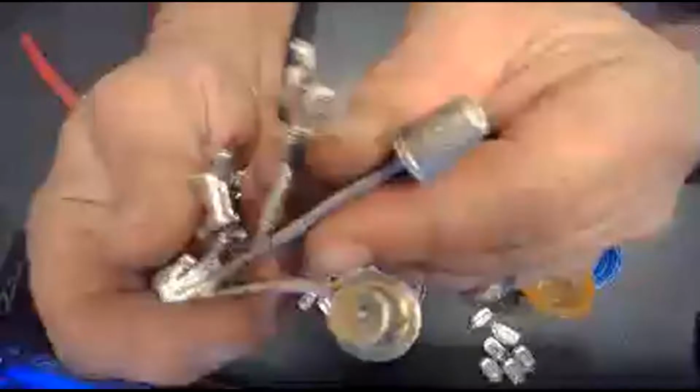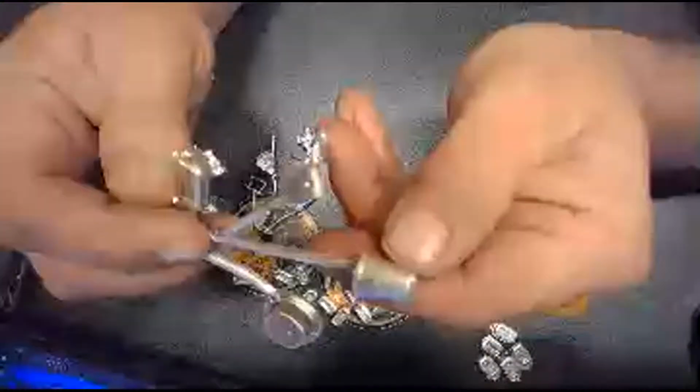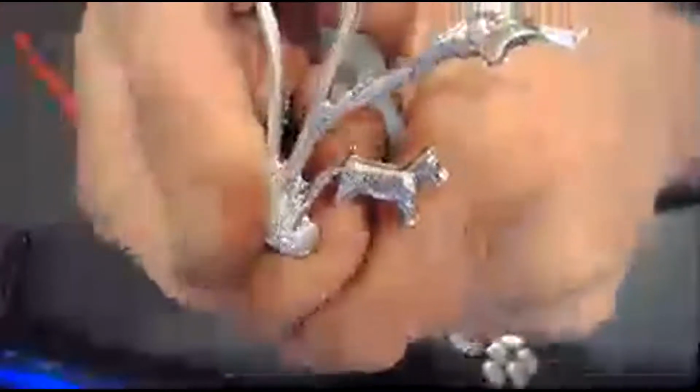But anyway, the thimble came out really good too. A lot of detail on it. I was kind of surprised when I pulled it out of the casting sand how much all the little dimples showed up in the thimble. And that casting line that's on that thimble, that's from the manufacturer. Yeah, I don't know. It may not be. I've seen it earlier. I thought it was, but it may not be because it's kind of at an angle. So that angle is from me pressing it really hard. Because with little stuff like this, I put it in the casting sand, and then I press it in the press and put more pressure on it. That way I get all the detail like in the dog. All the hair. You can see all the different strands of hair and whatever.